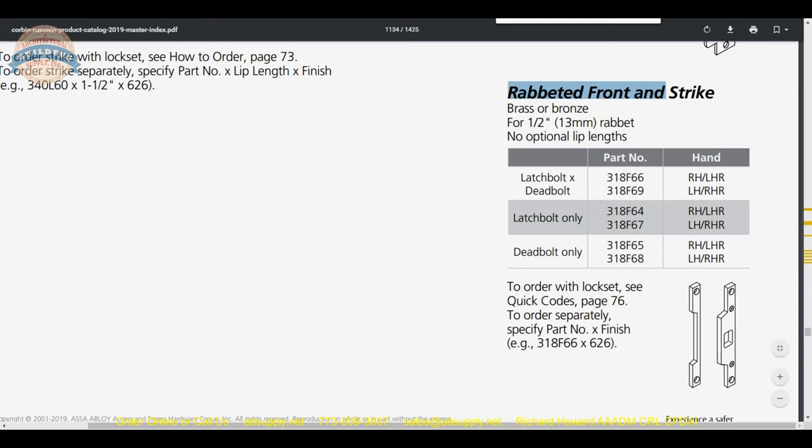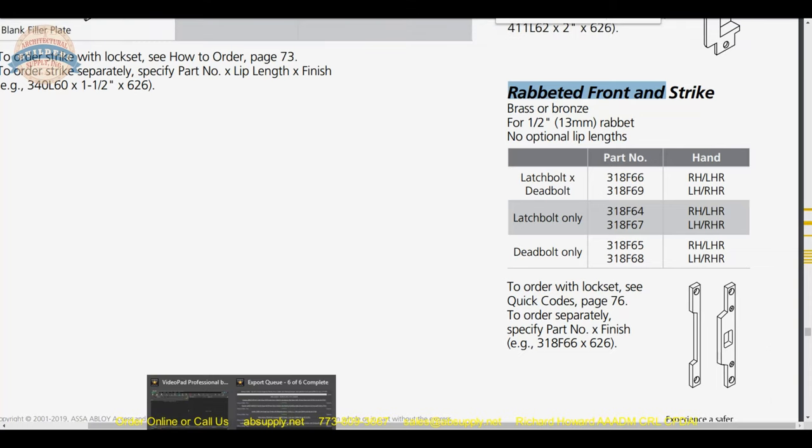That traditional style has a radiused, scalloped feature inside. They are added pieces — that is typical and normal. It allows them to take a standard lock and add the piece so you can have a rabbited environment. Rabbited doors are really nice because they are quite effective at weatherstripping for the intrusion of cold, heat, air, wind, and noise as well. Rabbited door edges are really nice.